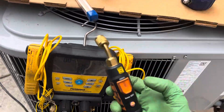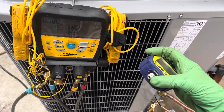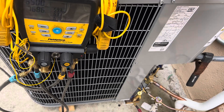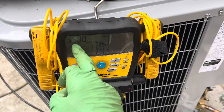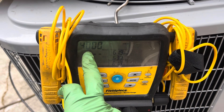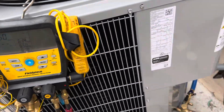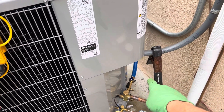I discovered my Testo backup batteries are dead and I'm looking for my adapter to do this the correct way. Right now I'm going through a hose — you already see we're in six thousand, five thousand, four thousand, three thousand microns. See how fast this is going down, and that's just using the one single True Blue hose.